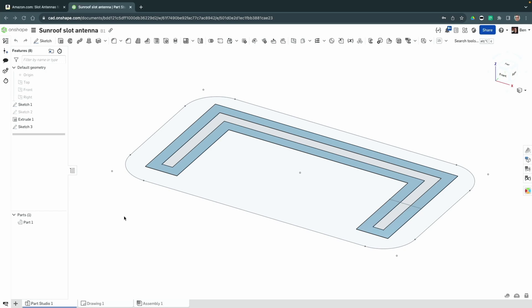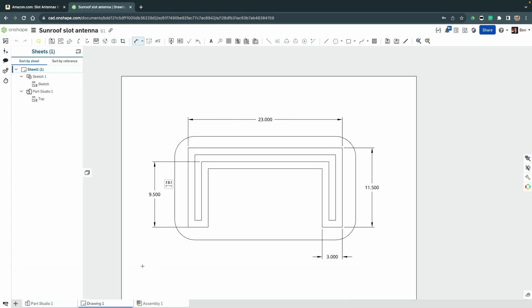One application is to throw the antenna onto a satellite dish. Remember, horizontal can be like this, but this is also horizontal — it's just rotating about that one axis. In John's book, he talks about the distances you should start with for the two-meter band. He recommends 39 inches for the inside slot. I kind of overshot, but it wasn't a huge deal — I ended up with a 40-inch inside slot. This gives you the measurements of the pieces of tape that you need.